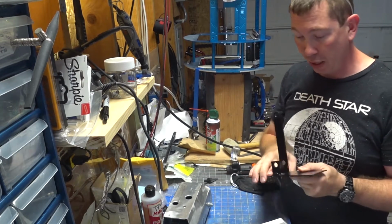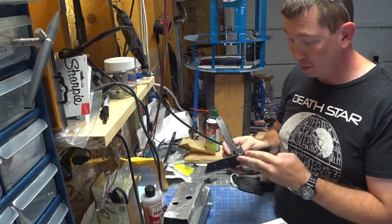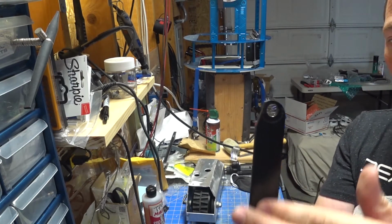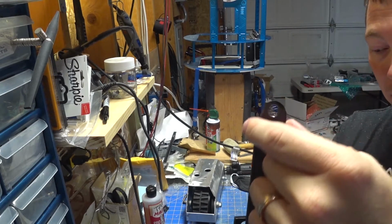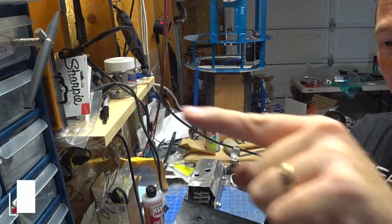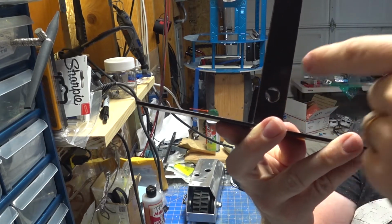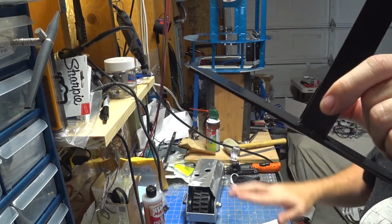Okay, so with that being said, there are a left and a right to these leg foot brackets that Kevin created. Let me move this back a little more so you can see it. All right, so let's get a good look at this. You have your main pivot shaft. This is where your pivot mechanism is going to occur, right here. This beveled, or notched, edge goes towards the front, towards your front linkage. Then you have your pivot mechanism, and down here is where the cotter pin and bolt will go through. The cotter pin will be on this side, and this is what will connect to your ankle on the outside of the foot shell.